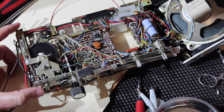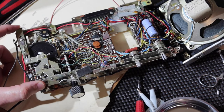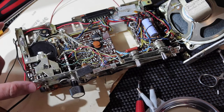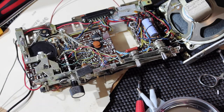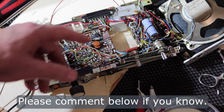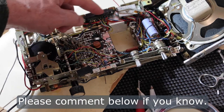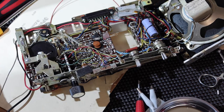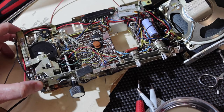I'd say it's got power going to it, yes, switching between the car power and the battery power inside this radio. But if you look at all these leads here, there's almost as many leads in here that are being switched. I'd have to find the wiring diagram from the bracket, but it looks like we've got power. We may have the speaker lead that's transitioning. I could take an ohmmeter and ohm out some lines that go to the speaker and buzz them out and see if I got any connections here. But if you have all those lines, it's kind of like, what else could it be? So I doubt the antenna goes through there, but it might. But anyway, pretty cool, huh?